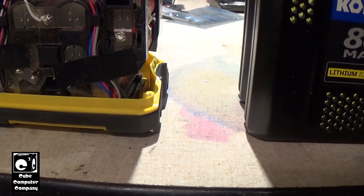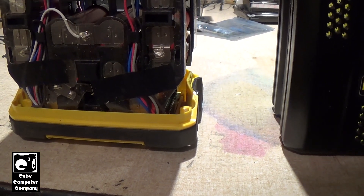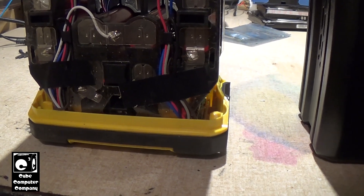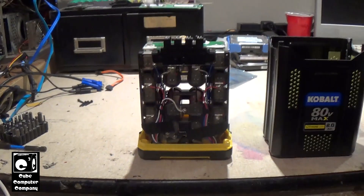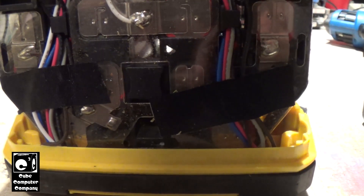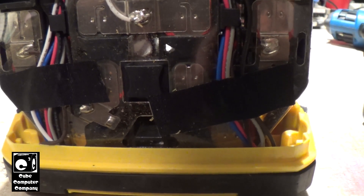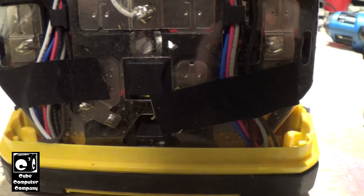Just a little bit ago I pulled it out and smelled it. It did not have a burning smell, but there was a chemical smell. I'm suspecting one of these 20 18650 cells has vented - not violently, but leaked electrolyte. You couldn't really smell it in the room, but if you held the pack up to your nose, you'd smell a sweet or tangy chemical smell.